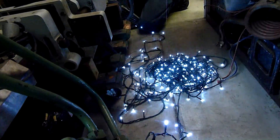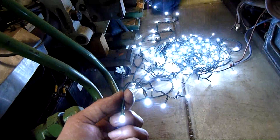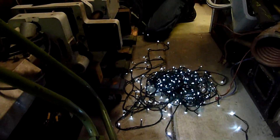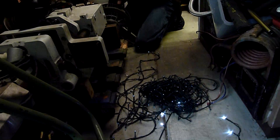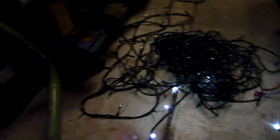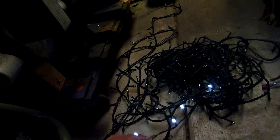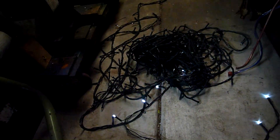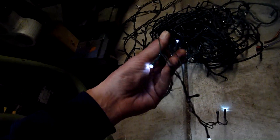Give it a good spin now. That is surprisingly effective. It's only just moving, only doing a couple of RPM. That's really neat — I just like the way they pulse. We know we get voltage at virtually zero RPM; at one or two RPM you get voltage, but the frequency of it is cool. I'm guessing these are almost tied together in a star three-phase configuration anyway.